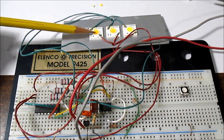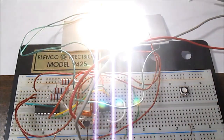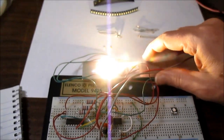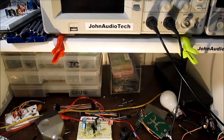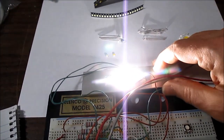This one is either 2700 or 3000 Kelvin, this is 4000 Kelvin, and this is 5000 Kelvin. Let me turn on the power supply — it's going to blow the camera out. It turns them all on and then sequences slowly through them. I'm not really driving them that hard — the power supply says 120 milliamps — but they really light it up. The neutral white one just switched on.